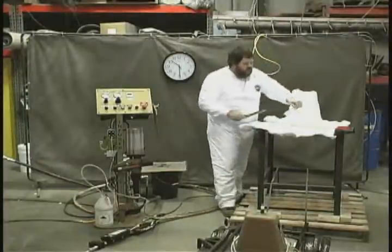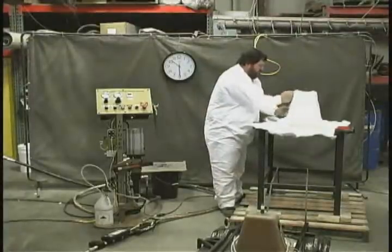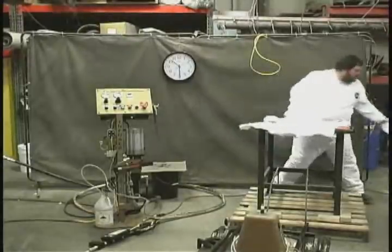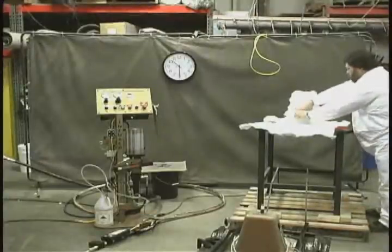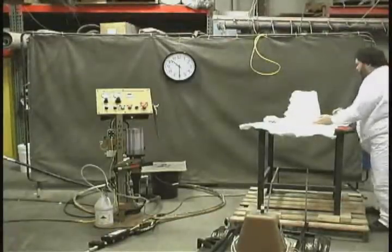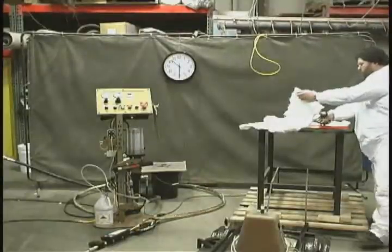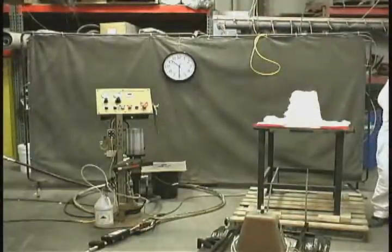What we'd like to show is the careful nature of the overlaps and paying attention to detail — loading into those radiuses, making sure the fibers form. The biggest myth of our industry is that the closure of the mold pushes the glass right in where it needs to be. That is wrong. You must form the glass to the mold shape, and the mold closure will just allow the touching of the two surfaces — the lower, which the glass is against, and the upper coming in contact with the glass. It's wrong to assume the upper will force the glass into place. It can't push the glass ahead; the best it could do is pull it tight to itself.